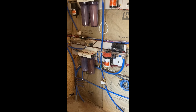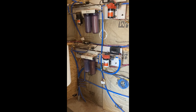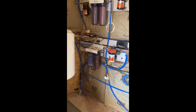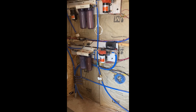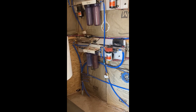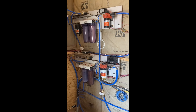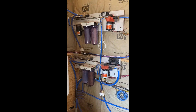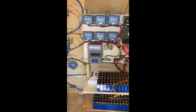We can shower on about three gallons of water, and as long as the water heater keeps up we have comfortable showers. The filters get changed regularly — I should probably change the pre-filter for the dome's main line; it's getting dark from sediment. We have very fine clay in the soil that can get into the tank, so there's a pre-filter for that dust, then a fine carbon filter, plus the UV sterilizer. The shower sump itself also has filtering stages before the water reaches the polishing system and UV sterilizer up top.